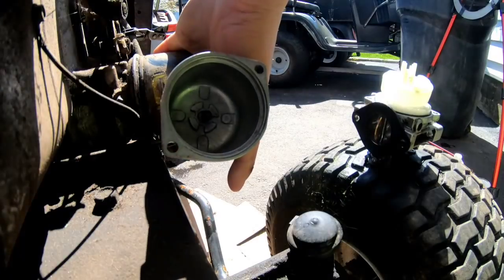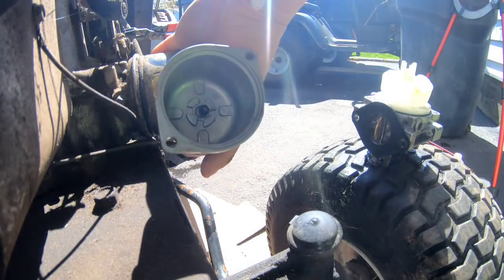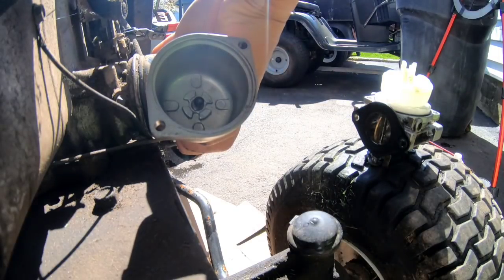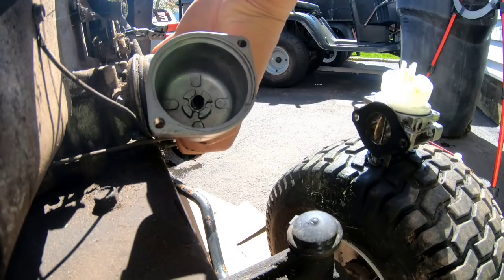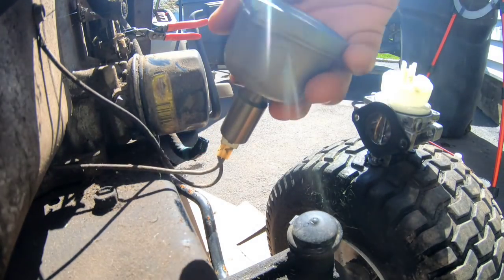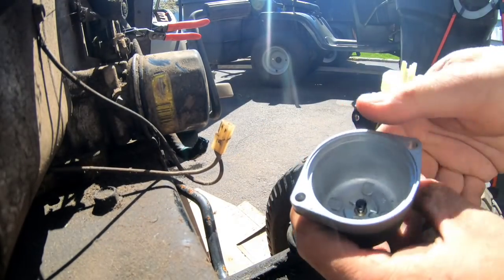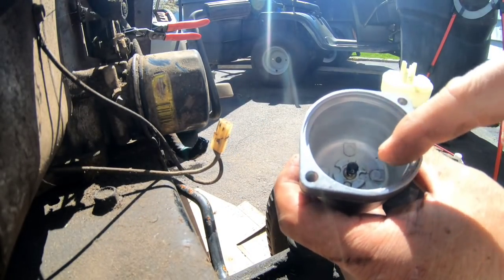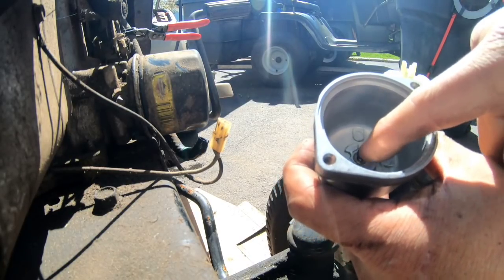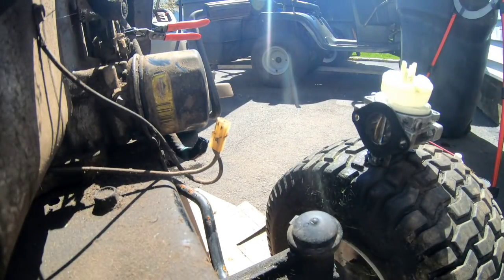Okay, I put the electricity back onto the fuel solenoid. See if it moves. It does pull down, and does retract. Pull down, retract. Pull down, retract. So I guess I'll keep it on there since I know it works. I don't like them. I usually just cut them because they cause problems. When you push it down, it feels a little resistance coming back up again, which is why I think I want to cut it, but I don't know, it seems to work. So I'll leave it for now until we have problems, you know?